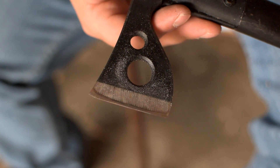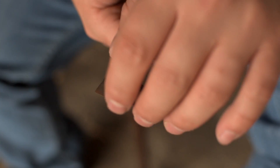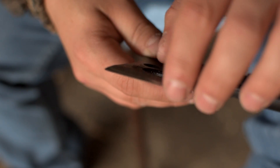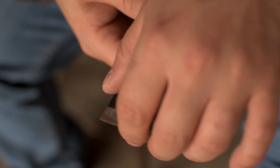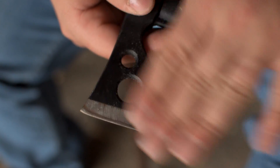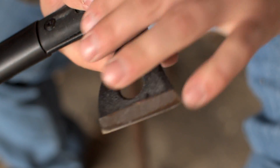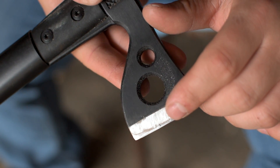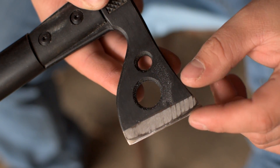You don't need to get too caught up in this filing part, as long as you've removed any big chips and dents and you've got a nice clean edge. It should be a nice crispy edge — you should touch it and it should feel kind of smooth but kind of grabs your finger. You can see little bits of filings there from where I reshaped this bevel. You see there's no chips there now.